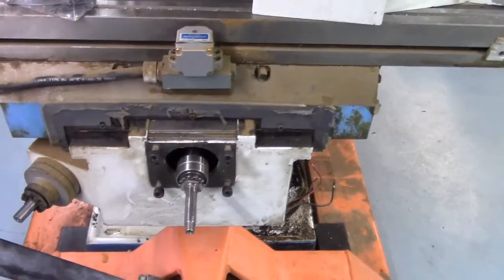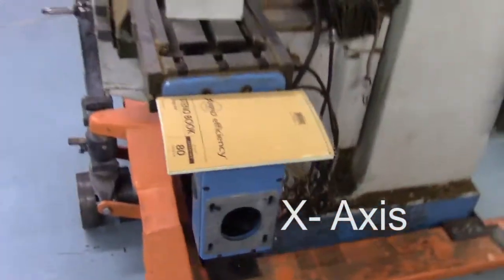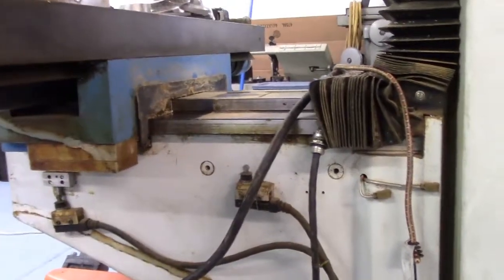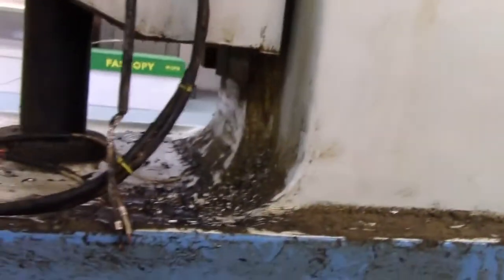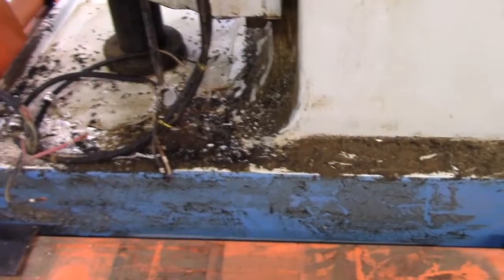Here's the front of the knee showing the thrust bearings and where the y-axis servo motor goes. I've already got my steno pad for notes for this machine. Here's a shot of the limit switches for the y-axis, and there you can see the box ways for the y-axis. You can just see the box way for the z-axis as well - it's a heavy machine.